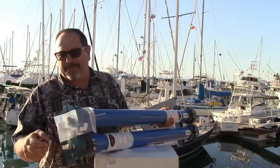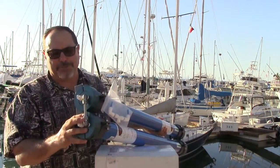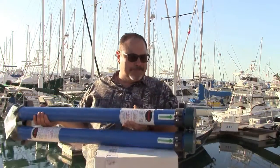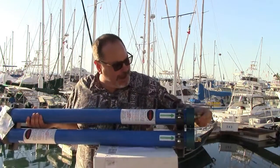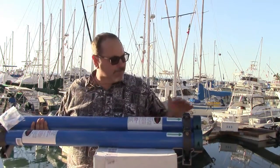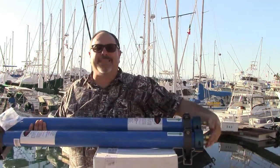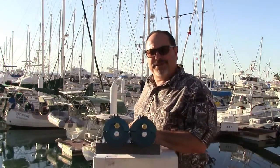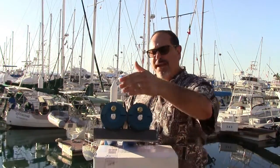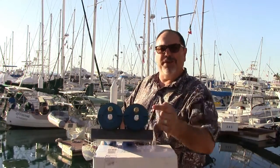On this side of the assembly you'll see a stainless steel tube. Seawater — you can see the flow directions — is entering the top membrane, flowing through, crossing over, and then exiting the opposite side. On one side of the pressure vessel assembly you have your high-pressure inlet and outlet lines, along with these low-pressure product water outlet lines.